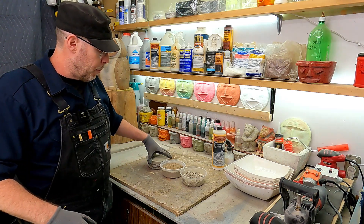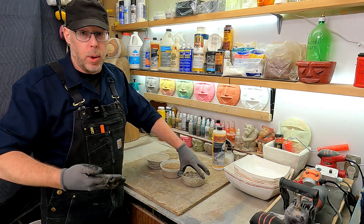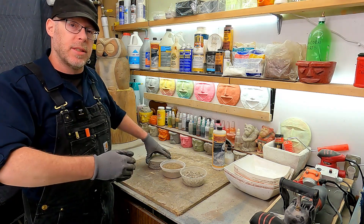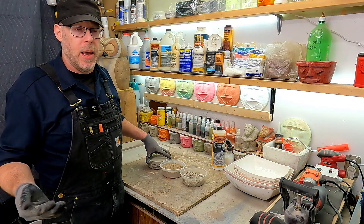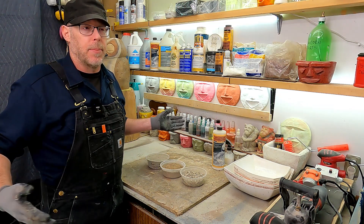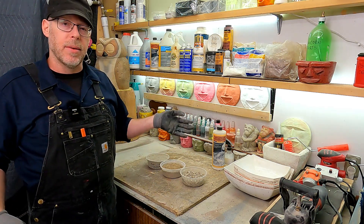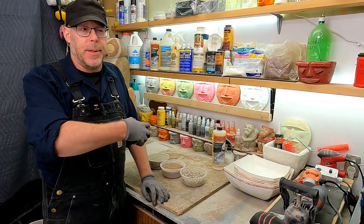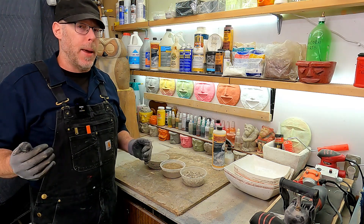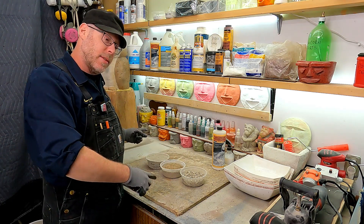So this is a great DIY mix design: one part cement, two parts sand, four parts gravel, replacing 10% of the liquid content with acrylic or latex paint. For more dramatic color, locate and use white Portland cement instead of gray. This mix will handle anything up to but not including structural or engineering-level projects — sidewalks, steps, potholes, repairs, custom pieces. It gives you strength, water resistance, and optional integral color. And it's pennies on the dollar — extremely cost-effective when you buy the base components in bulk and mix your own concrete.